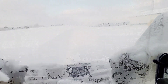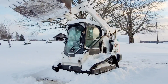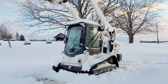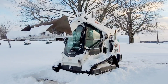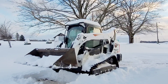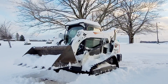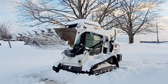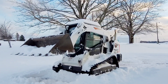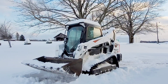It's going to take time — it can be very tempting to want to rush through this. Nice and easy. Slow and steady. Once you get up to the position where you're ready to switch and go back down, pause for a brief second and go down easy, nice and smooth — not rushing anything. I've also seen guys curl the bucket back the whole way and just hold it there. You can hear the pumps whining, the engine whining — it's really hard on things that way. You're jamming it the whole way and it's not good for it. Guys can argue it warms up faster, but that is hard on everything. Just get all the fluids flowing with nice, uniform motions in all positions.